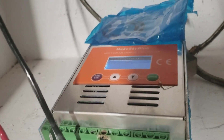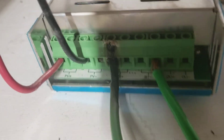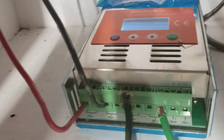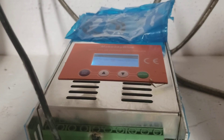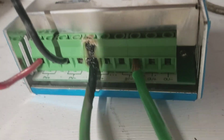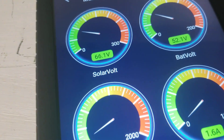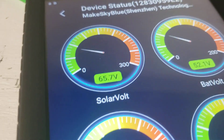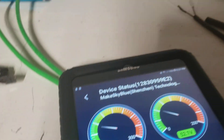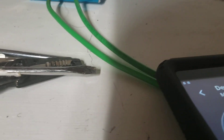After one day I noticed my battery wasn't being charged. I checked and couldn't figure it out. When I came back I found both wires were in the same positive hole — that was the error. The only real flaw this machine has is that the wire connections tend to burn if a wire gets loose. The manufacturer needs to fix that. Right now I'm producing one amp — there's no sun out. I'm about to turn it off, remove this wire, put it in the other hole, and tighten it up.